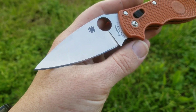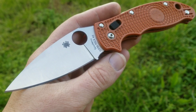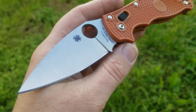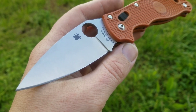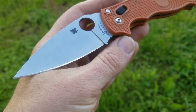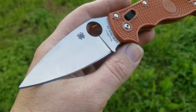What I wanted to do was sharpen it and do two different cut tests using standard cardboard from Walmart — the small cardboard boxes you can buy there. The first test I sharpened matching the factory angle, which is close to 30 degrees inclusive, 15 degrees per side, finished on a 600 grit silicon carbide stone, put a slight micro bevel on the edge with that stone, then stropped on six microns. The second test I resharpened the same way but did not put a micro bevel on that edge.